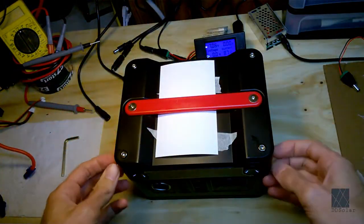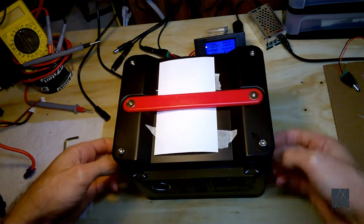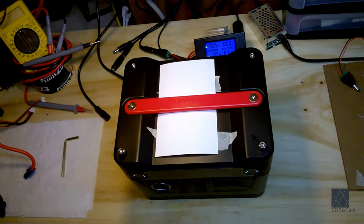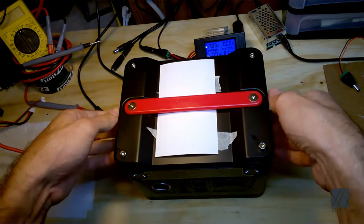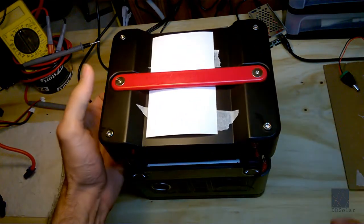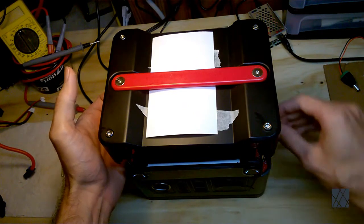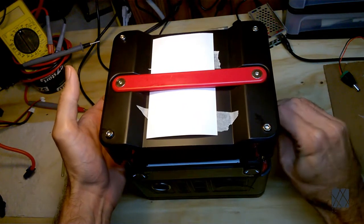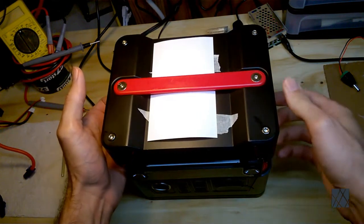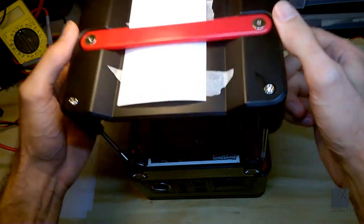Now when I take something apart, I find it helpful to take photographs, and it helps you remember where everything is. And let's go ahead, lift the top off. Now on the right hand side there will be fans, and those are usually glued in. Now I've already cut the glue, so I found it easy, but they're on the right side and the wires aren't that long, so you got to be careful. Just lift the top off.